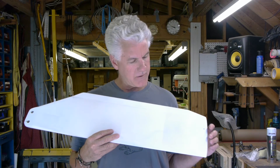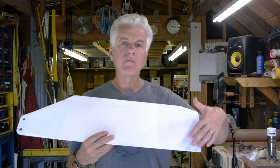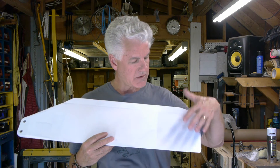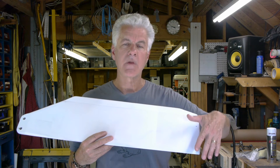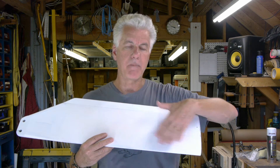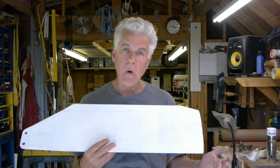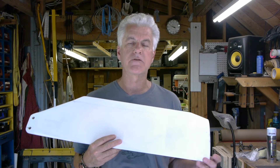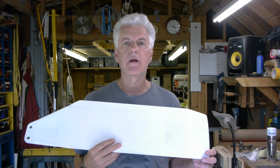This is the second blade, the one I'm still working on. There's been some damage on the end from the tail rotor strike — a gash in the end and some streaks on it. So I poured some epoxy on it, sanded it, put some bondo on it, wet sanded it some more, then put a coat of primer on it and got it all straightened out. It needs a coat of white paint and then we'll do the red stripe on the tip and it'll be ready to go.